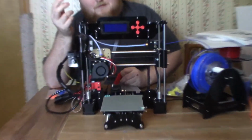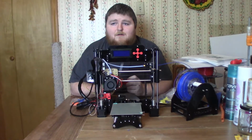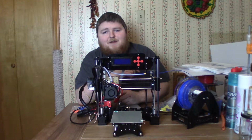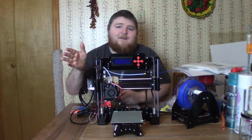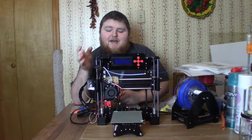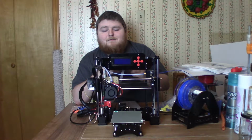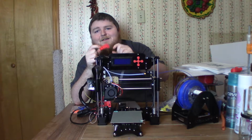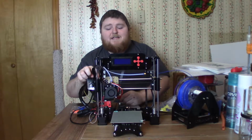Now, instead of buying new screws, I created my part where it has a back cavity that is wider than the nut. That way the nut can go into that cavity up to a certain point and cinch down on the plastic. Essentially, you get the width of this in terms of where you're actually cinching down at, but you get the thickness that you need for this to hit the limit switch.